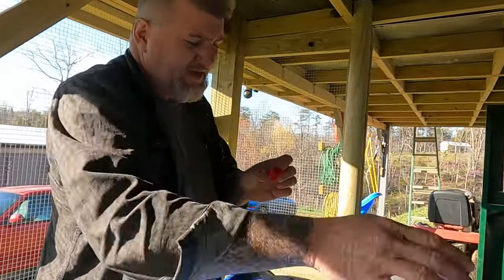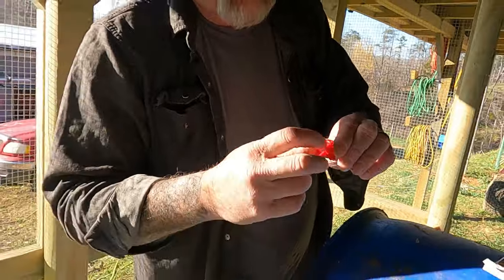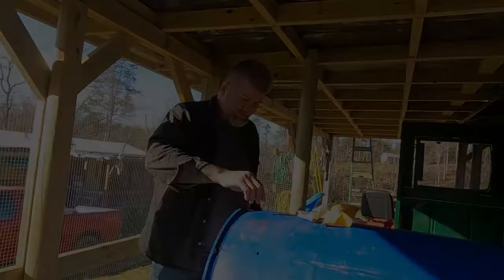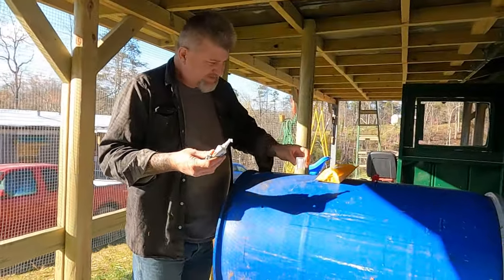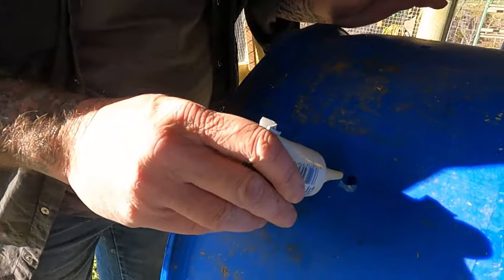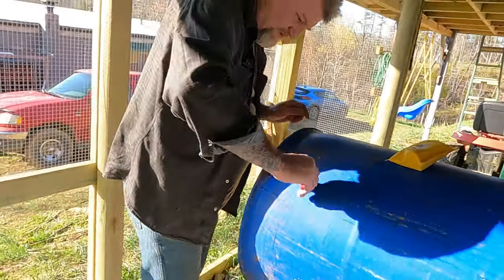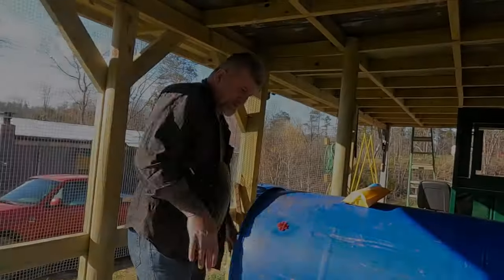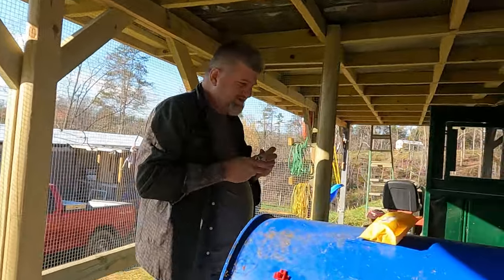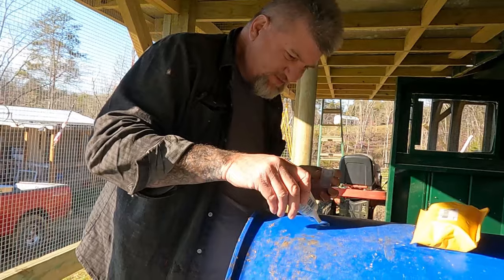These are the little nipples - same ones we put in another barrel. They work good; you have to peck at it to get the water out. The ones in that container in there are a little better quality. I'm gonna put a little dab of silicone around the hole like this, just a little, and then screw it in - kind of glue it in there because the holes are honestly just a hair too big. Putting three more in because I'm gonna set this barrel in there too. It's better than having it out here not being used, especially when we've got plenty of water.